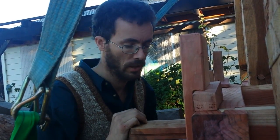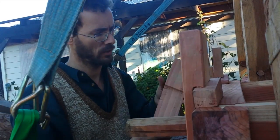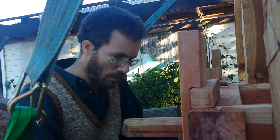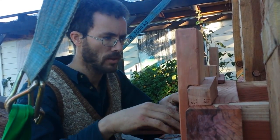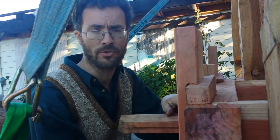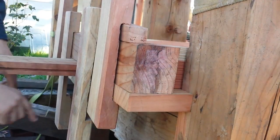The reason these clamps are longer is for the center three boards. For the very center floorboard — the tapered floorboard — I can't put one of the shorter clamps here because the taper board is going to come out. So with these longer clamps I'm putting them either side of the sliding tapered board, and then underneath I'm putting another piece of 4x4. The three floorboards, the back of the tub, and that 4x4 underneath all clamp together to hold it in place and tighten up that joint across those three boards.